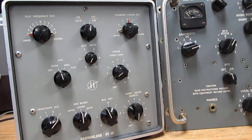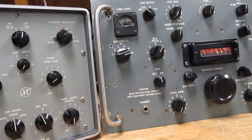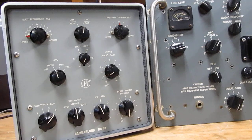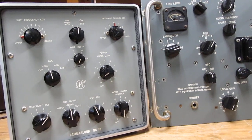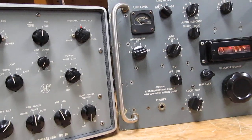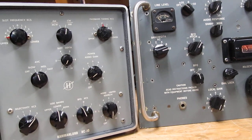It's got a noise limiter, and I've got it connected to a Collins R390 here. The R390 is a good receiver in its own right — it's got mechanical filters in the front end — but it does not have a product detector, so this comes in real handy for that. Plus it adds three more stages of IF filtering. The amazing thing about the HC-10 is it's virtually noise free — the 60 kc amplifiers just do not add any noise. You can disconnect the input and listen and you virtually just don't hear anything, so it's a very quiet addition. The R390 is handy to use because it's got an IF output already set at 455 kcs.